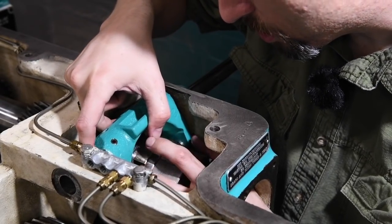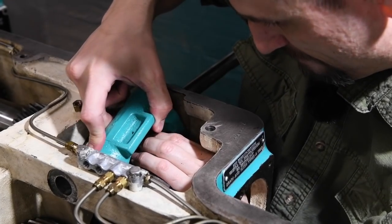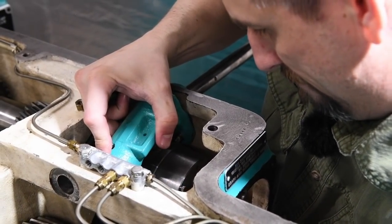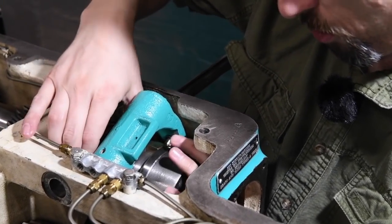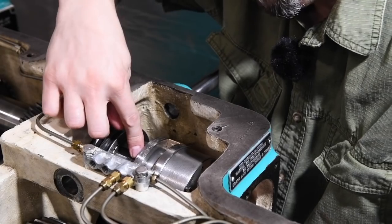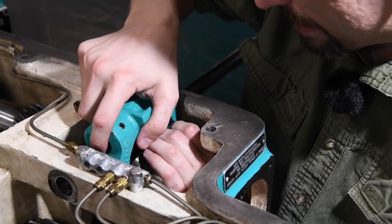That's roughly where we need to end up. There is just so little room in here. Ugh. Making this all just a little bit worse. On the shaft, there are three external keys, internal on this, the brake assembly housing, or whatever it is. So in order to move this thing back, it's gotta have those keys pushed in. So I think maybe what I'll try is getting this guy in all the way, and then dropping this guy down onto that back shoe.